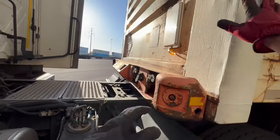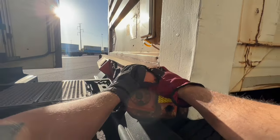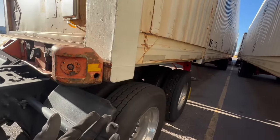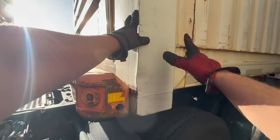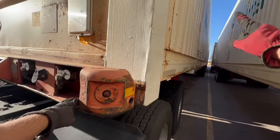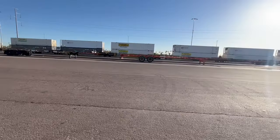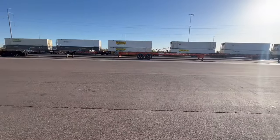The reason being is because these are two separate pieces. This here comes off of this chassis. So this chassis will have all the functionalities that you will find in a regular trailer, such as lights, reflectors, braking systems, the whole nine yards. This separates by a big crane when you unlock everything, and I'll show you the locking mechanisms throughout. It picks the container up from the chassis and loads it onto an actual train, and then it gets transported to its destination.